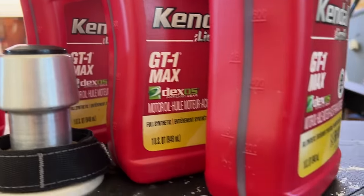It's not exactly the greatest day for throttling out — it's pretty bumpy today, not ideal. But she is running really good. There are a few reasons to own a ski boat. With an inboard-outboard, when you're pulling a tube that thing can cavitate — if you turn very hard you get a bubble around the prop. On this boat you can do it full lock at prop height at any speed, turn the wheel, and it's going to go that direction. You don't get any wishy-washy — it's pretty locked down and it always grips.